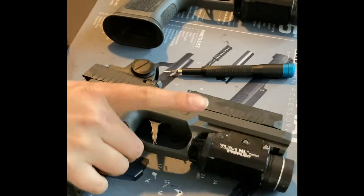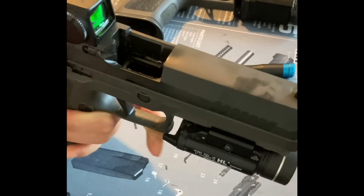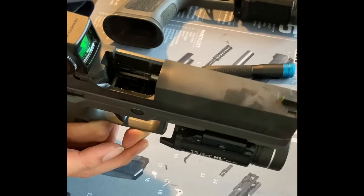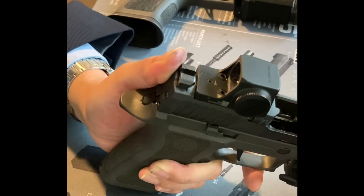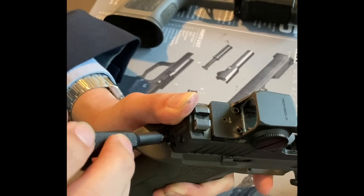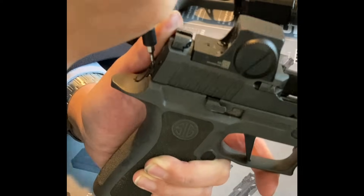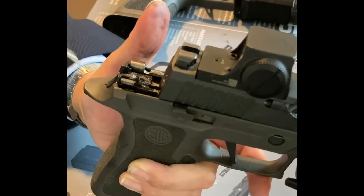This is a simple test that anyone can do with their P320 to verify whether the sear moving independently of the trigger could potentially cause a negligent discharge, or what everyone's calling an uncommanded discharge. I think it's kind of a dumb phrase, but that's what everyone's using. This relies on the fact that you can actuate the sear by using a long pokey thing to come in the back through one of these gaps and press down, without having to touch the trigger at all for the sear to move.